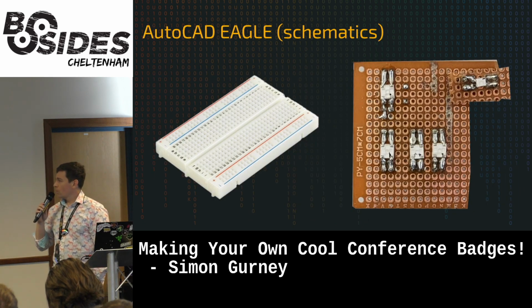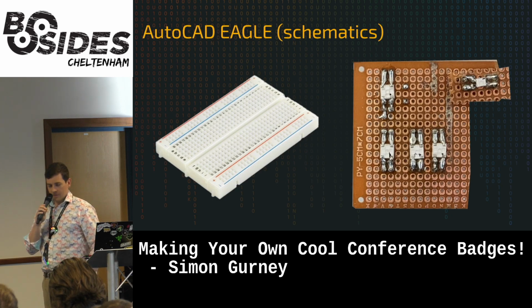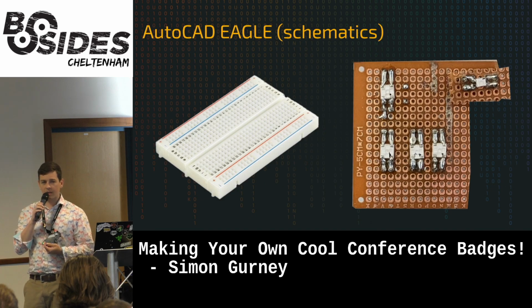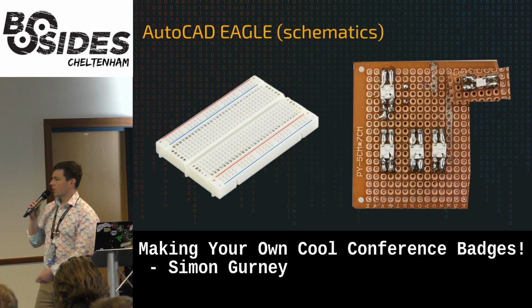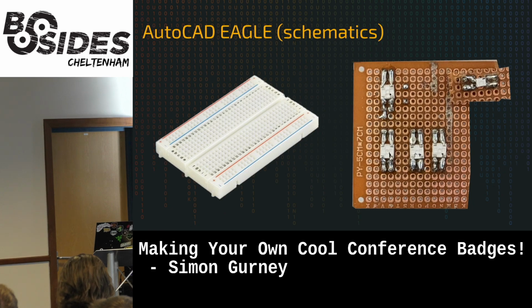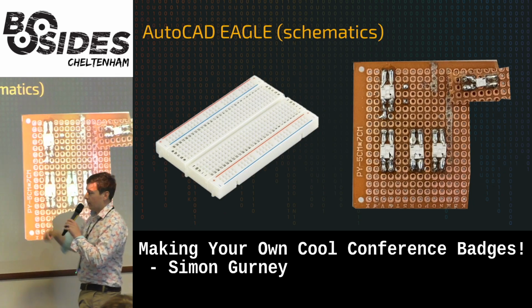So when you're first doing the badge stuff, it's best to get your electronics done first. The feedback loop for these is pretty big. It's about 3 weeks to get some prototypes from China. So don't just do a schematic and think it's going to work and then wait 3 weeks to find out it doesn't. So over on the left is a breadboard. These are electrically connected in the columns here. So you can quickly prototype on them.